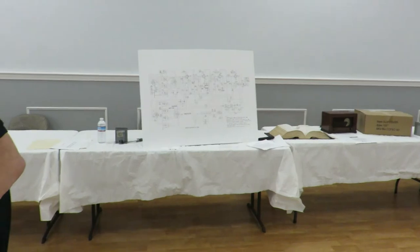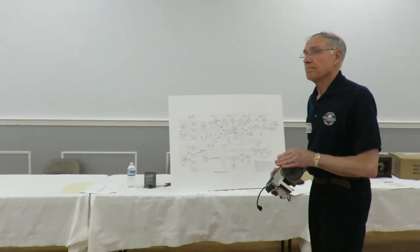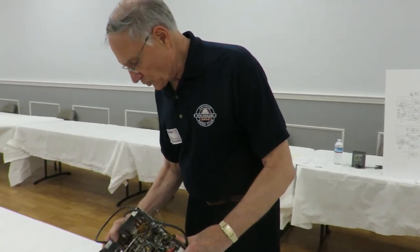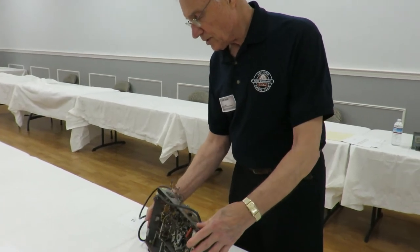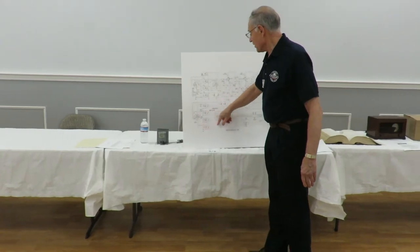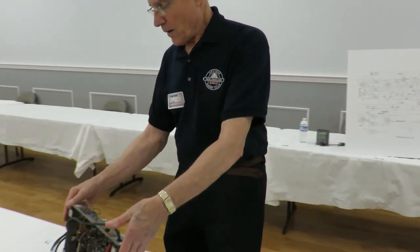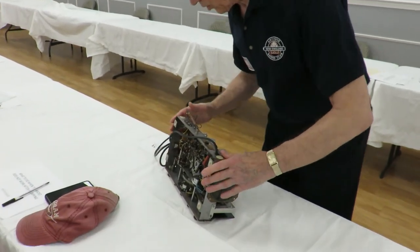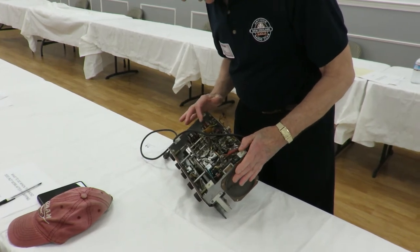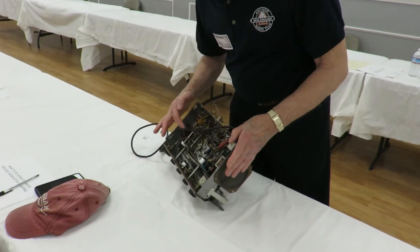So, on the left of your picture of the schematic, yes. Three transformers, where are they on that? Okay. These are the transformers right here. The question is, you've got these transformers, you've got these transformers. Again, these are for the antenna, and these are for the oscillator, and they're right under here. So they're all of them? They're all, yeah. And they're marked on this right there. The top ones are the antenna. So these are the antenna ones. You've got these for the antenna, and these are for the oscillator. And they go through the switch.